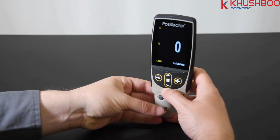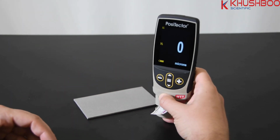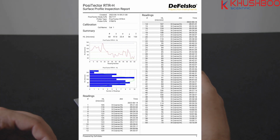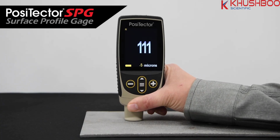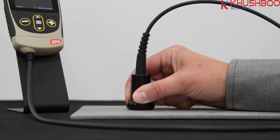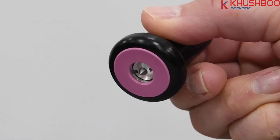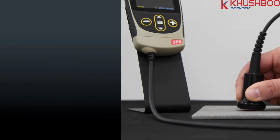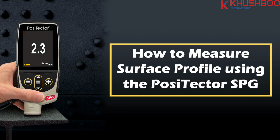When paired with the PosiTector RTR replica tape reader, measurements are digital and can be stored, saved, and reported with ease. DeFelsko's other solution for measuring surface profile, the PosiTector SPG surface profile gauge, uses a digital depth micrometer fitted with a fine-pointed probe to measure profile height. Learn more about the PosiTector SPG and the How to Measure Surface Profile using the PosiTector SPG video at the link in the description below.